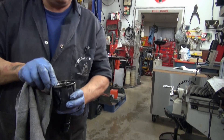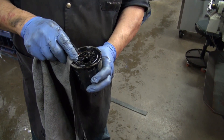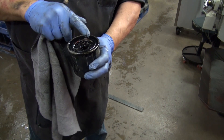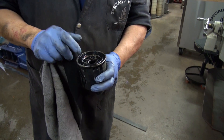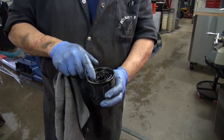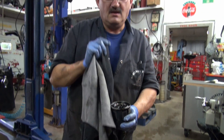There's a rubber O-ring on all of these filters. Make sure that rubber O-ring is on that filter when you remove it. If it's not, it's stuck onto the block — and if you don't notice it and you screw on the new filter with the new O-ring, you've got a double O-ring. When you start your engine it's going to blow out one seal, you're going to lose your motor oil, lose your oil pressure, and you could lose your engine. So it's imperative that you remove that O-ring off the engine before you put the new one on.